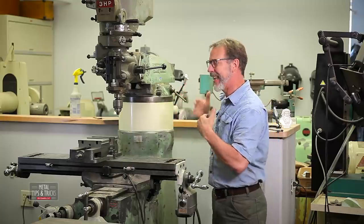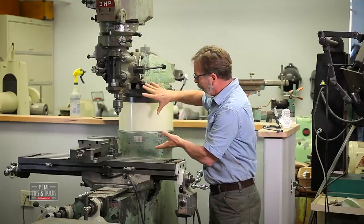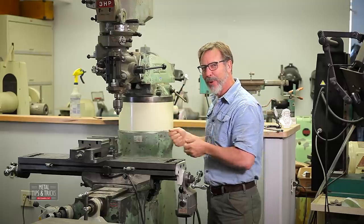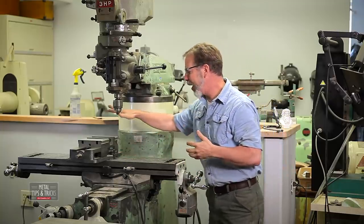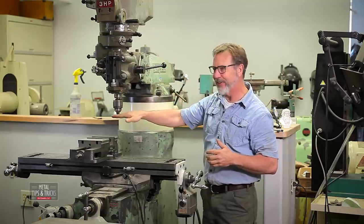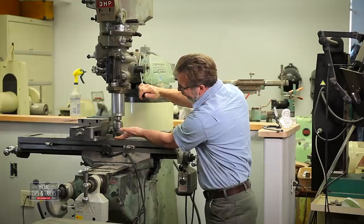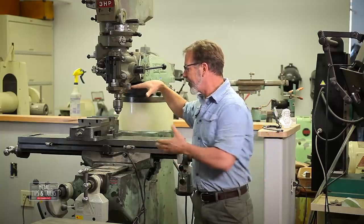Let's talk about the advantages and disadvantages of a riser block. A lot of people say you lose capacity because technically on a milling machine without a riser block, the quill should touch or come very close to the table. But you always have a cutter in there and always have material. Unless you're working with your cutter out a quarter inch on sheet metal, this distance doesn't need to be that tight. I do about 95% of my work in a vise, and if I raise the table all the way up, my vise almost hits. The quill can come down — with the Jacobs 14N chuck in, I'm just about 5/8 of an inch away. With the vise I've got plenty of room, and I've never come to a situation where this gap caused me problems.